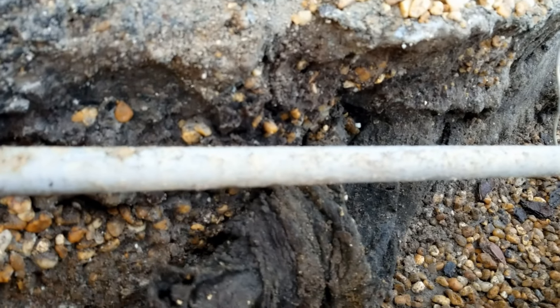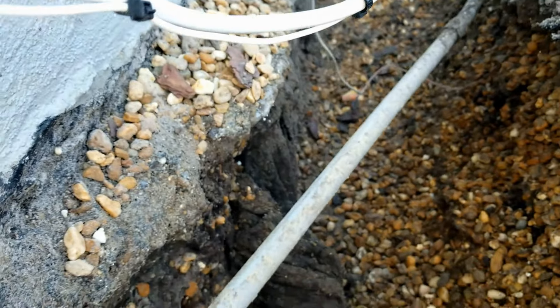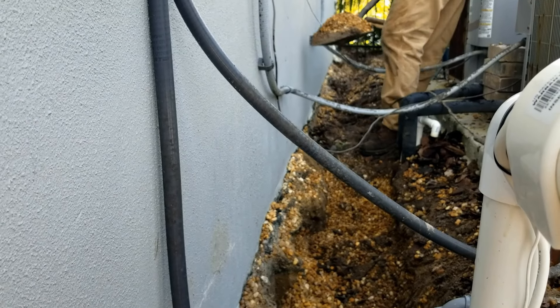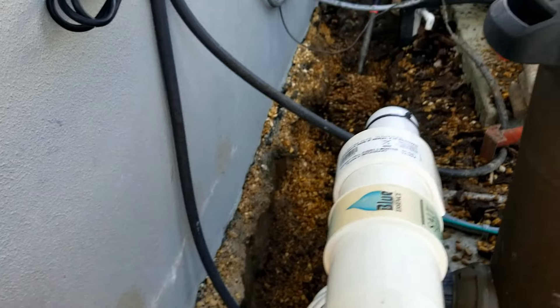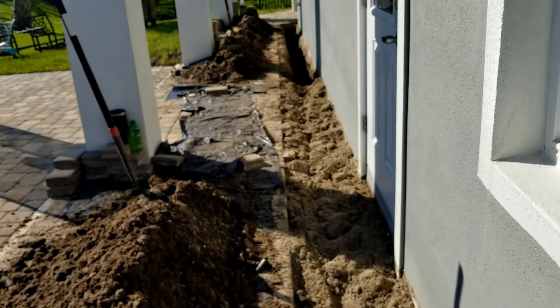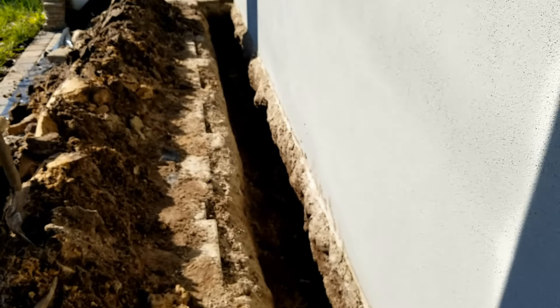You can see some things here that were causing problems. I don't know what exactly this is — some kind of fabric liner that they've got underneath of the floor. Real wet back here. What we're doing is trying to get rid of that gravel and get it out of the way. This is just slow going — it's not that it's hard digging, but you can see all the obstacles in the way. Be careful you don't get it in the AC and stuff like that. We'll take some other soil from over here where these two guys are digging along the back wall. Beautiful little trench going down through here, looking real good. About 15 more feet to go, then we'll be able to clean that wall and start to seal it.